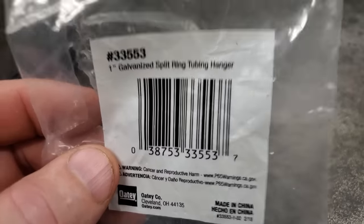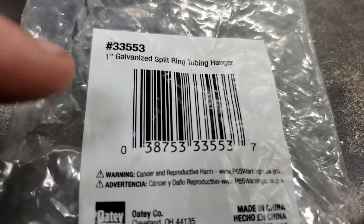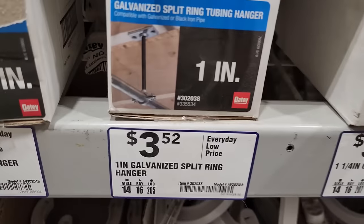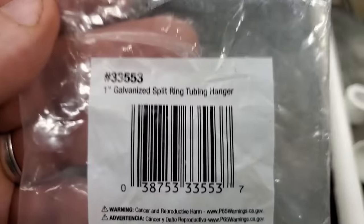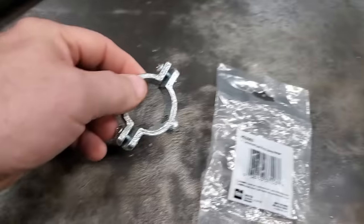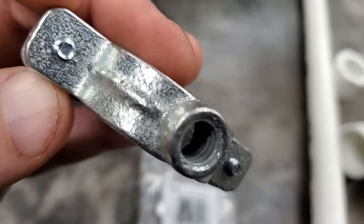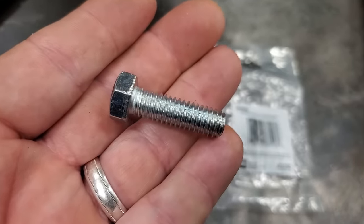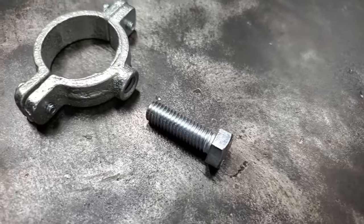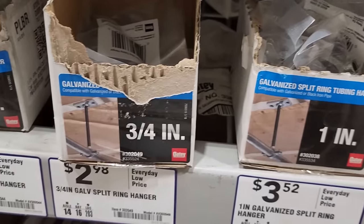Now, this next part was the very interesting part of this rod holder that makes it really cool. And this is the idea that I got from one of my subscribers. And this thing right here makes this rod holder a game changer. And it wasn't easy to find either. But I got a 1 inch galvanized split ring tube hanger. Wasn't easy to find because I didn't know what it was called, but it looks like this. And it's made to where it's not going to rust, and it's really strong. I mean, it's all metal. But it's made to go around 1 inch pipe, and it's got a threaded side that you can put a bolt in, which, by the way, you'll have to buy separate. And you'll have to figure out which bolt you need according to which hanger you use. You see what I'm saying? Bolt goes right in there. If you're going to use a 3/4 inch pipe, you can also get these galvanized split ring tube hangers in 3/4 of an inch. I'm just saying.